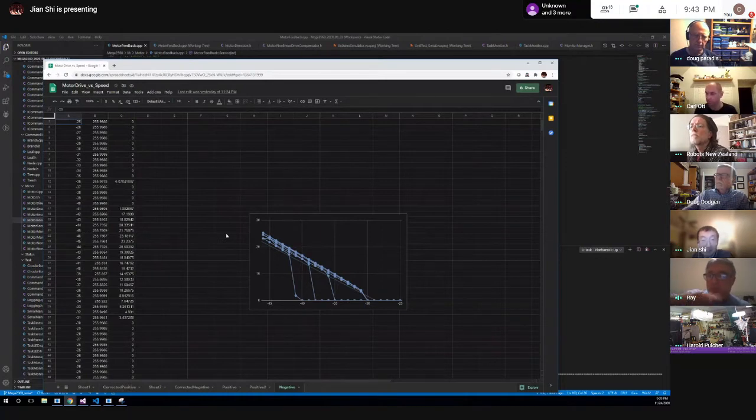John, when you try to get it to go to a position, does it go to that and then oscillate back and forth? Right. It's kind of natural because when the error is small, my drive will be small. When it stops and I need to turn around a little bit, it won't turn because the drive won't be able to kick it off. By the time it kicks off, it overshoots, because the integrator already integrated too much error there.